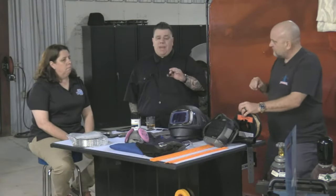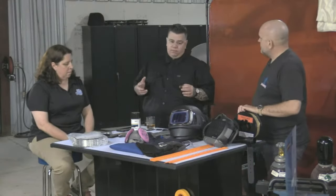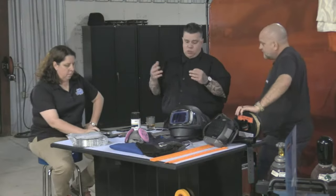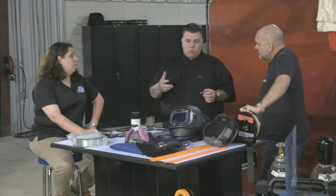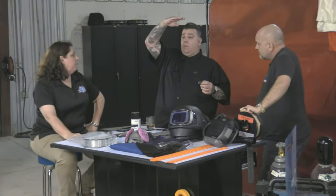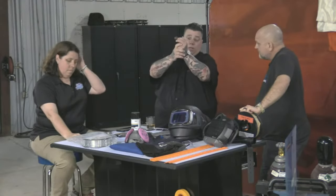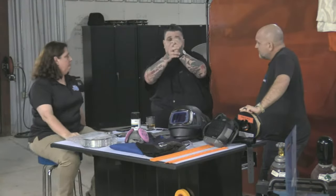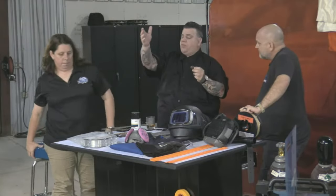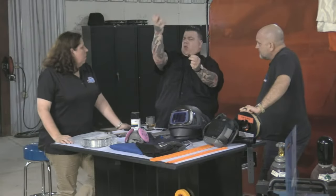All right. So welding helmet, jacket, gloves, respirator, eyeglasses, boots, pants. And I'll be honest with you, this is the biggest problem I see when I teach guys welding. I go to a lot of places and teach advanced welding to shops after they've taken the ICAR course. When you weld overhead, which is from your eyebrow or above, and you always want to have it at your eyebrow level, and you want to be close to it when you're welding, either from the side or welding aluminum, you're welding this way towards you. All the sparks are flying at you.